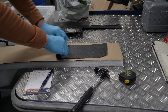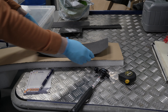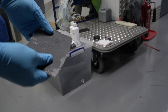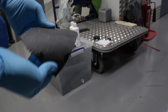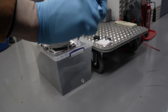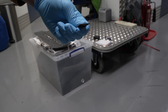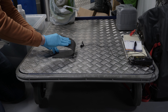This is interesting. If it really were a super-weak rubber with fabric merely draped within it, you'd expect the hammer to almost pass straight through, exposing a tangle of visible fibres — but no. The laminate remains coherent with no sign of the impacts. The polyurethane has distributed the energy, but the sheet's behaviour is totally different: I can feel my own fingers pushing from the other side, and you can roll it into a much tighter sausage than the epoxy one would manage. It does return roughly to flat again, but there's clearly been internal damage — no cracking sound, though.